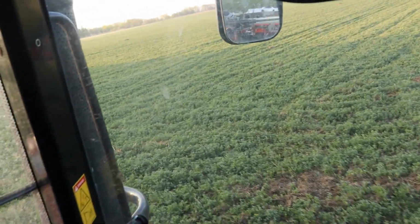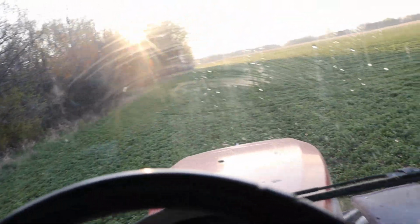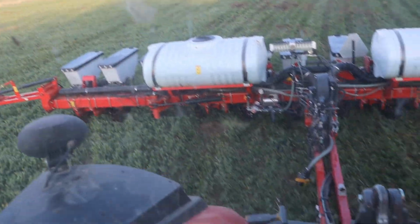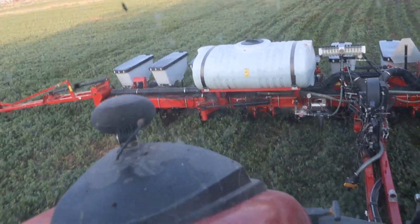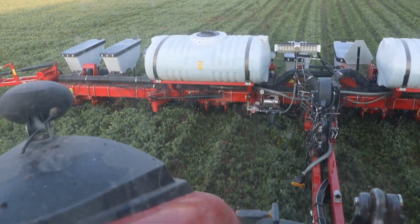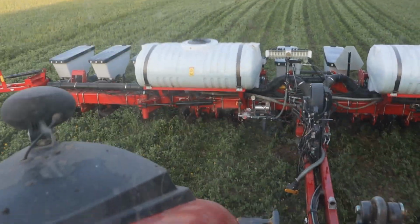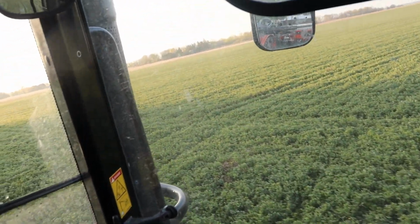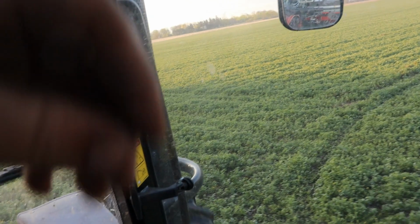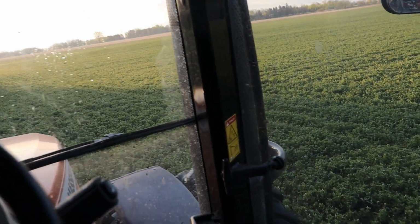All right, so we're getting going. I had to stop and lift up the trash whips and get the trash whips all adjusted. I had a couple row units where there was a mouse, so I blew the air. I turned the air blower on and had the seed discs off to clean out the air system for mice. And it worked, except on one row unit, 2 row units, their nest stuff plugged a seed tube, and they're like, you little buggers.